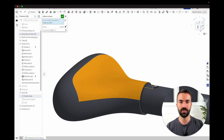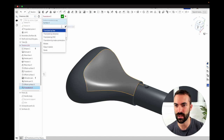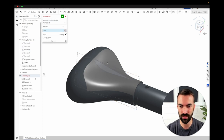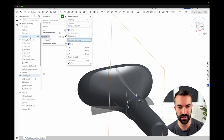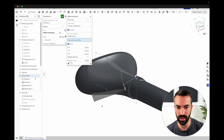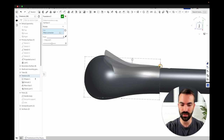To create the pattern, first I take this surface and offset it. I like to offset surfaces at a dimension of zero — it essentially just copies them. With this surface offset, I select it, use the transform command set to rotate, and need an axis to rotate around. Instead of making anything new, I'll just pick a point from one of my old sketches — hold Shift so it doesn't inference anything, then mouse over the point and let go of Shift. It's twisting the wrong way, so I go to realign, set the primary axis to the right plane so the blue Z axis goes in the same direction as the right plane, then flip it to go upward. I'll pull it a bit closer because it will impact how much falloff we get at the edges — something like 5 degrees looks pretty good.